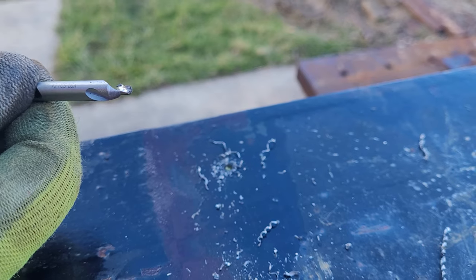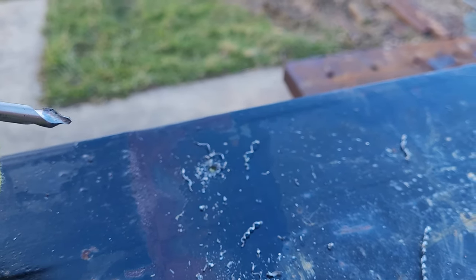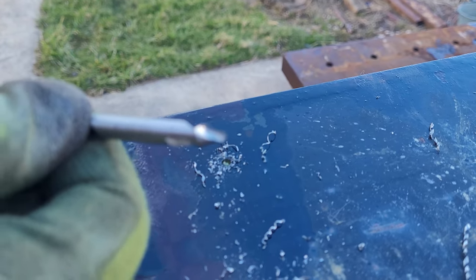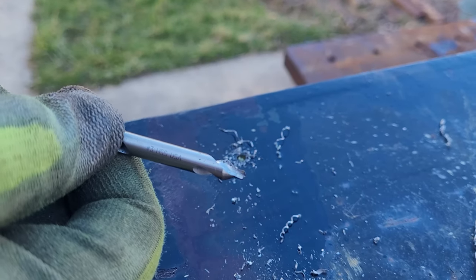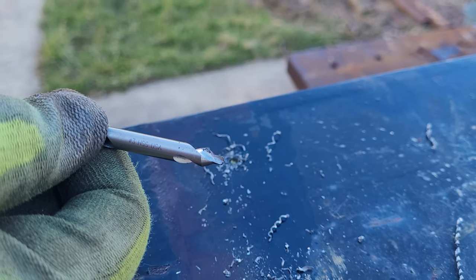What I did is use the 6-inch piece of channel, pre-drilled with the center drill, and now I'm going to drill with a smaller guy, and work our way up to just a titch over 5/8.